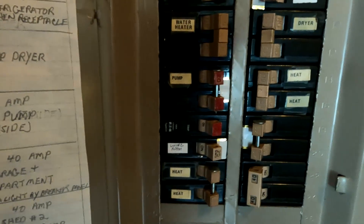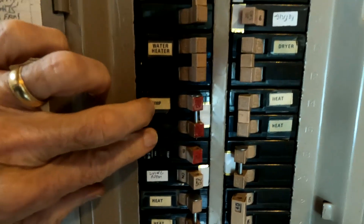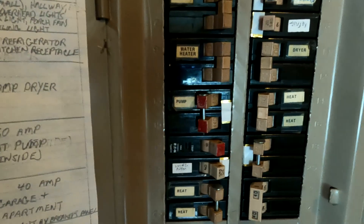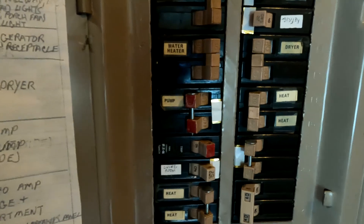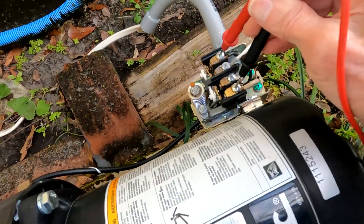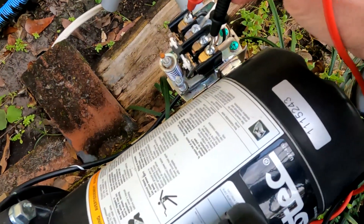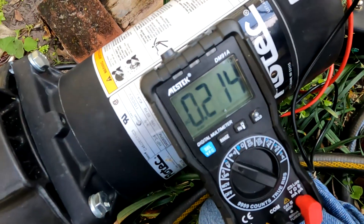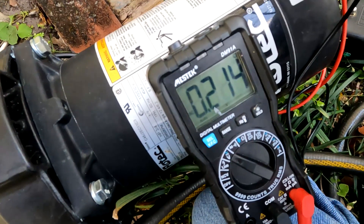Let me go to the circuit breaker and turn it off before I switch the pump over. My circuit breaker right here — we're going to cut power to the pump. It's out. Two poles on here for our 240 — I'll switch that off. Anytime you work on your pumps, make sure the power is switched off and double-check it outside. I've got the probes on my pressure switch and the meter is reading 0.214, so I'm sure there is no power coming into this pump.